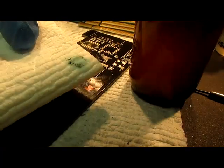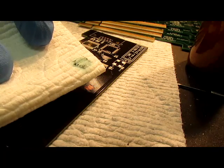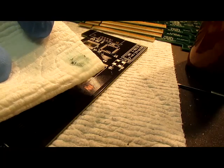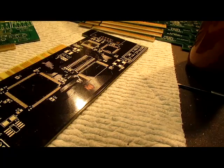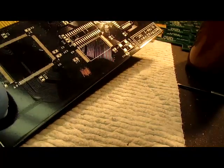I've got a little stannous chloride testing solution here. I'm going to apply a drop of that and see if we get a reaction — and there's no reaction, as you can see. So there's no gold there. More than likely this material is just copper; I can see the copper color on the circuit card.